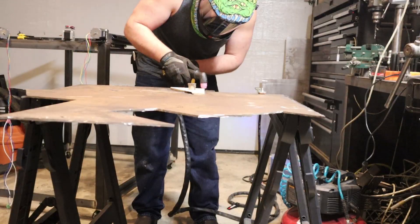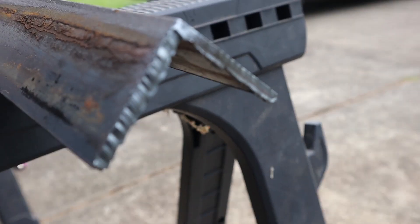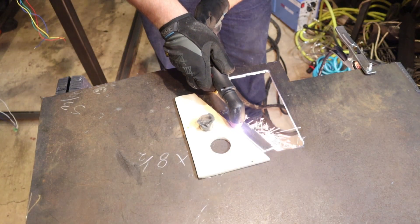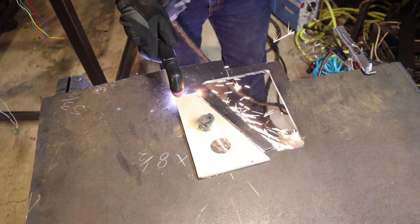In general, the plasma cutter works really well. I love the ergonomics of the handle, and it's got instant power delivery — you pull that trigger and you're going to have all the power you need right away. Since I'm not that skilled with the plasma cutter, I struggle with doing straight lines and keeping the distance from the work piece. Making jigs can help facilitate a straighter cut or following a specific path. I made a jig out of wood and when I'm done with the cut, it follows that line perfectly. Cutting jigs work great, especially if you're going to mass produce something.